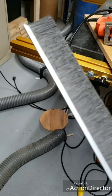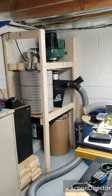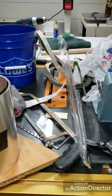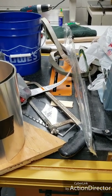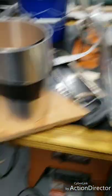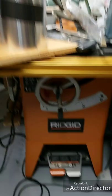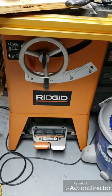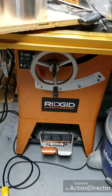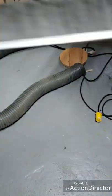What I'm going to do is get a couple of baseline measurements just the way my dust collector is — I'm still waiting on my takeoff. I'll grab a wind measurement with the gasket material off, with it in place, and then with the brush material in place, to see how much extra airflow I can get by sealing that off. The nice thing about the brush is that even if I use miter angles, once it's in place it'll just flop around as I adjust my blade angle. I think it's winner winner chicken dinner.